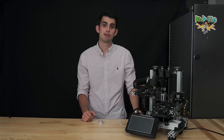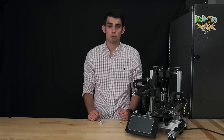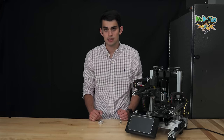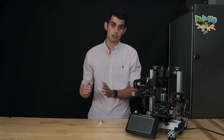It should be noted that most 3D printers don't have this drive chain. The only pulley you typically have to worry about is the driver pulley in the closed loop belt configuration. This pulley usually has 16 or 20 teeth. Let me reintroduce the demo before we discuss the optimal teeth the driver pulley should have.